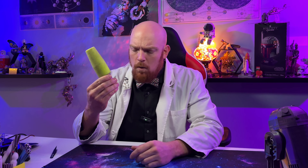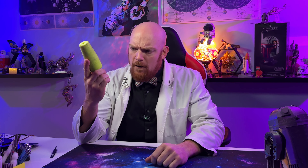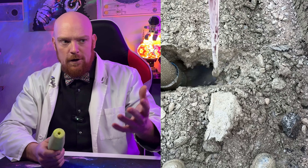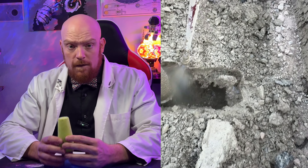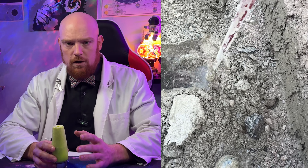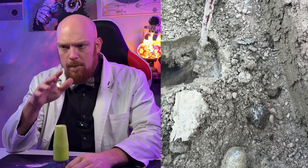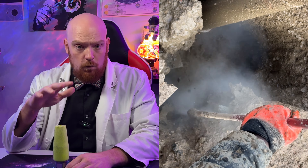How is it doing on performance? The first time I fired this thing on the end of my wand and turned on the water, I was almost completely blown away by the amount of pressure I had. Typically on my truck I operate Hydrovac nozzles at about 2,600 to 2,800 PSI. With this particular tip, that was just way too much pressure — you don't need it. I found that about 1,600 to 1,800 PSI seems to be the optimal operating range.